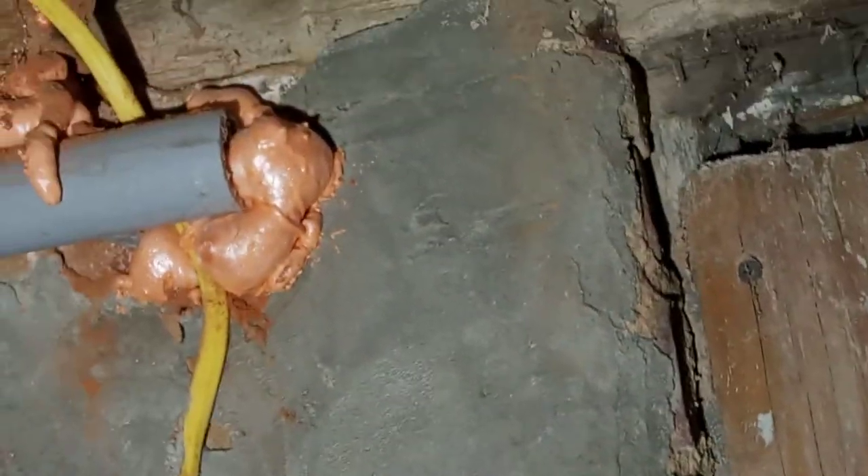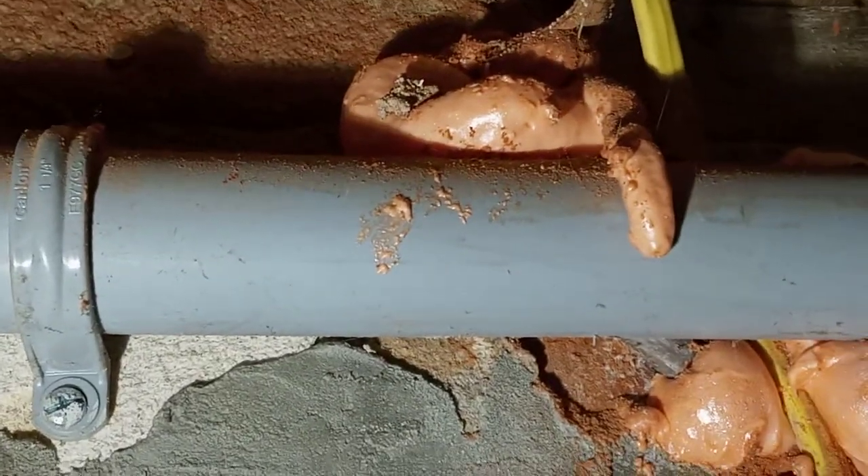That notch might have gone all the way in. Can we reuse the sill? I've reused sills many times — the city allows reuse if it's stable and you have enough material to bring it in. In this case we're getting rid of one layer of brick, so I can see this sill being reused — not an issue. I'll submit this and we'll see where we go. There's an old power line anchored to that wall with electricity — that needs to be addressed. Also a gas line coming through — we need to make sure we don't break the gas line outside.